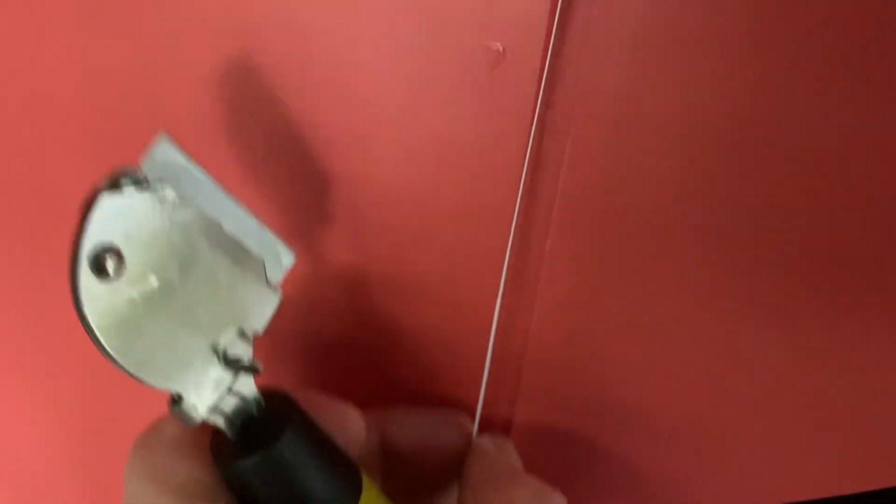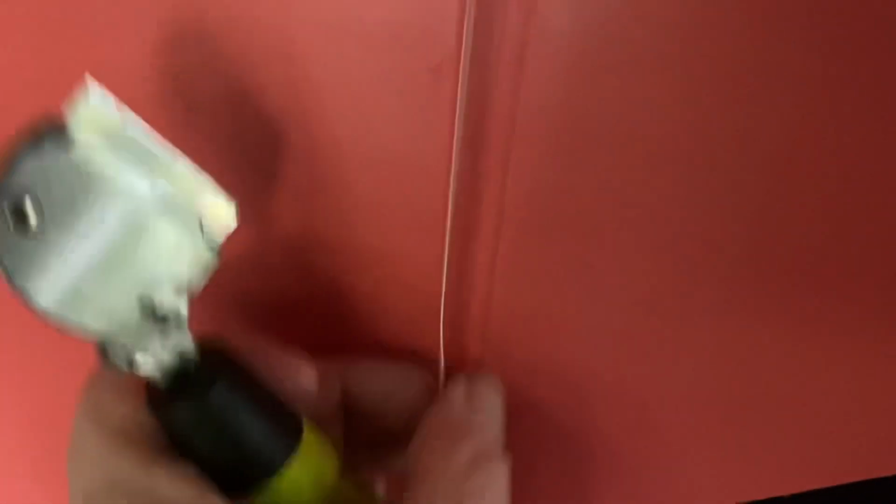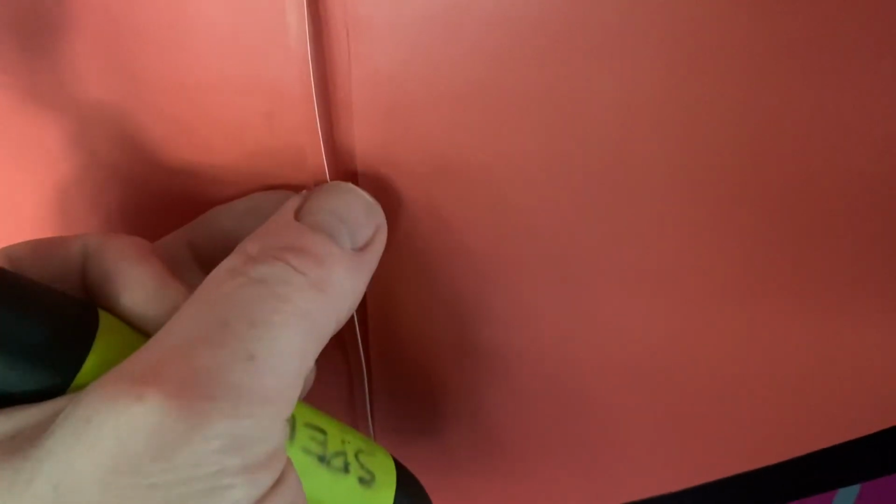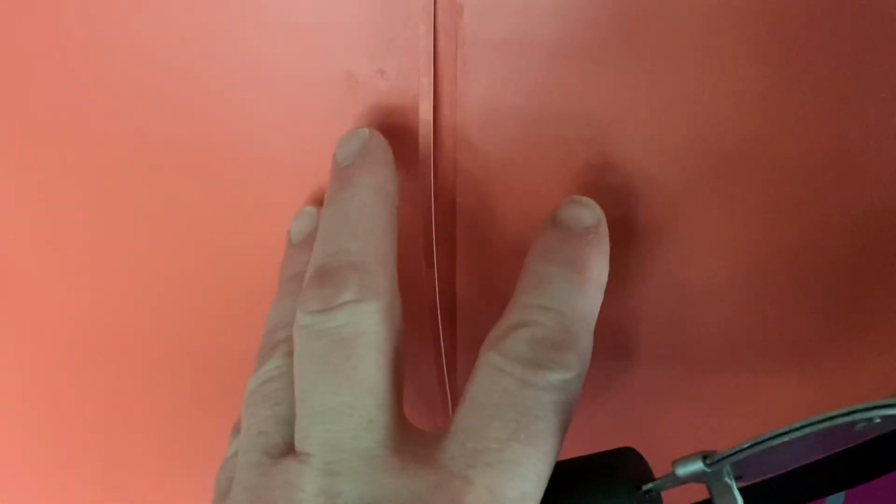The rest is attributable to flattening it out and making the two sides, the two edges, flush. That's the best you can do in order to avoid having a white seam. After that, you can leave the rest up to the wall underneath it. Any imperfections will raise one side of the seam and not the other, thereby creating a white appearance. But we do our best. That's why they invented the seam roller and the heat, because it allows our seams to be flush.